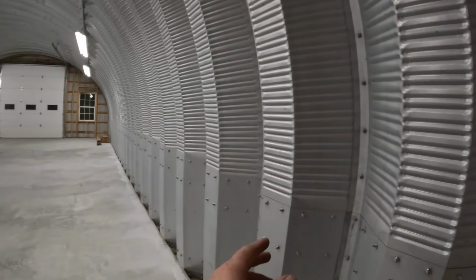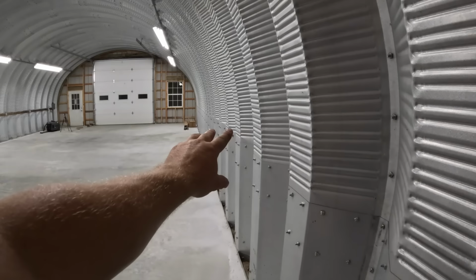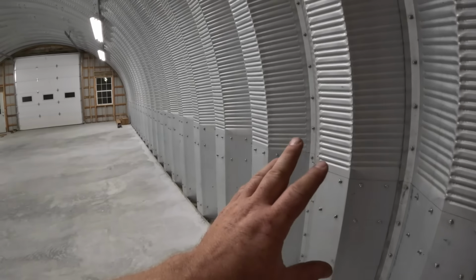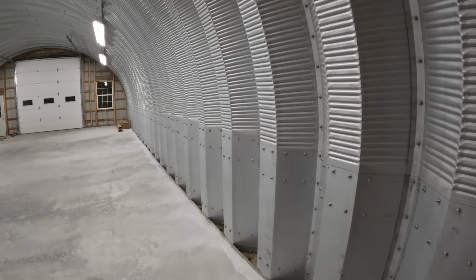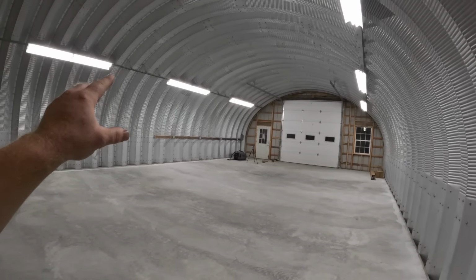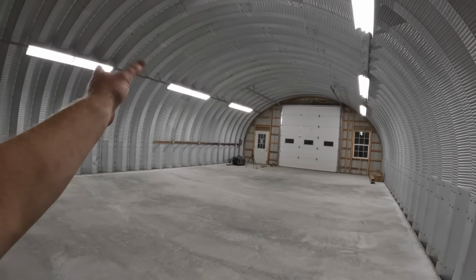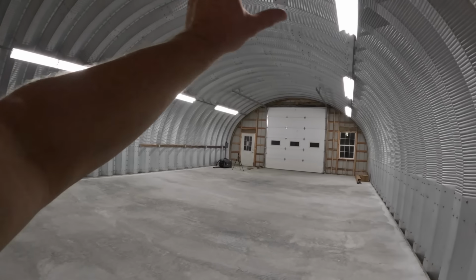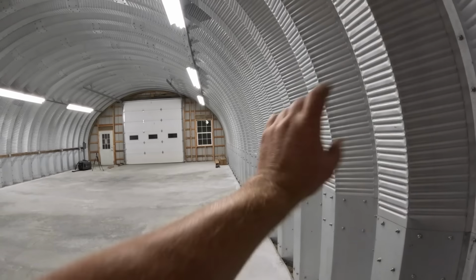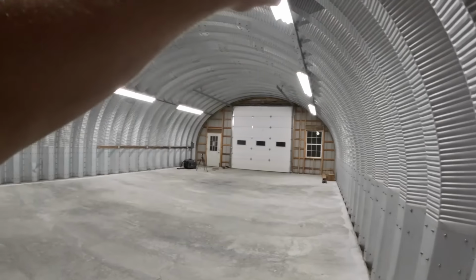I also thought about putting the purlings on the wall, so like over there, that 2x4, so basically running 2x4s down. They would have to be screwed from the outside, with a rubber washer, self-tapper, and put purlings every 3 foot all the way around, then have a spray foam, and then get some white metal roofing and steel, whatever, and then it would bend around, and they're 3 foot wide, so you would have white. I could cut them so the lines go up and down, and then make it go this way all the way around.